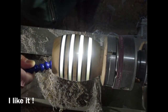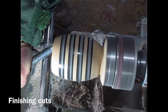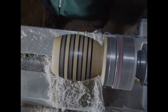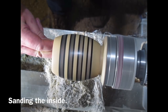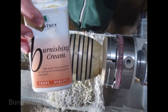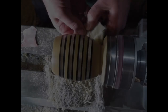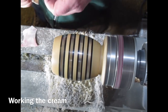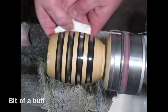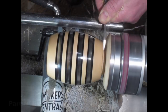I was very pleased with how this looked. I'm doing a few finishing cuts now — I angle the cutter at quite a steep angle so you're almost shear scraping with it, and that was the best way to avoid chipping out of the resin. Then sanding the inside, which was really difficult. Back to the burnishing cream, re-burnishing the outside slightly as well and doing the inside — you can see how clear I'm getting this. It's very thin-walled, about four millimetres, with a nice even wall thickness.